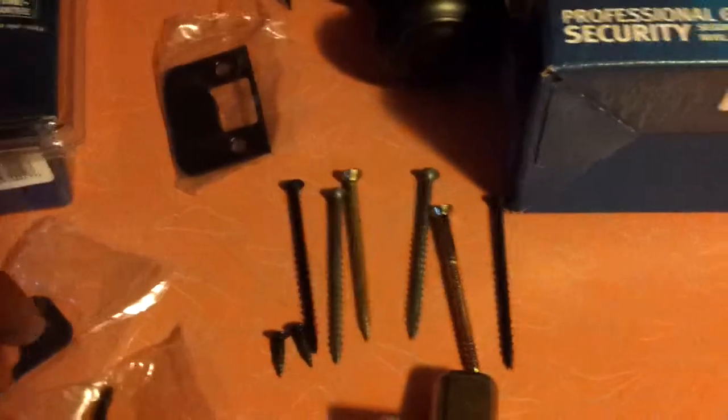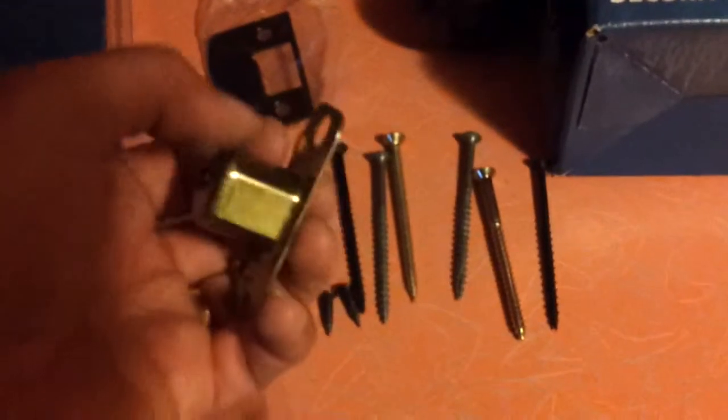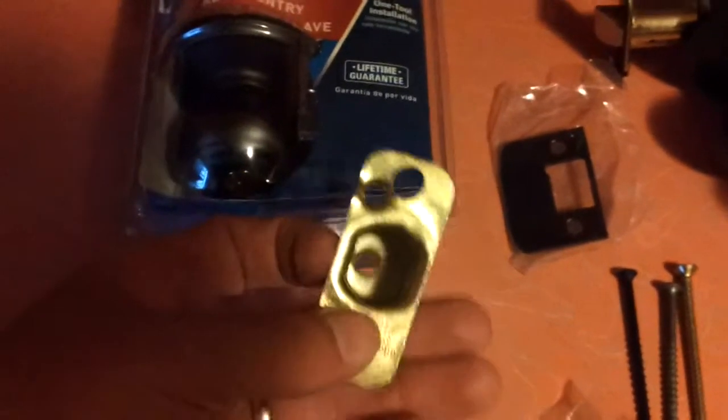You'll have a double stud right there in the door. This is also what the deadbolt goes into, and this does improve your lock a lot. If you have this reinforced strike plate, it's a pain to put in — you have to bore this entire thing out, chisel it out. But it slides in and it's made for a deadbolt. Well, if you have this behind it, you can drop in some massive screws — even one right in the back — and it will sink into the studs behind. Not relying on that tiny piece of wood that someone kicks and cracks. If you drop in some monster screws deep into two or three studs, it's going to take a lot more kicks to get in. They're better off trying to take it off the hinge side than coming in through the doorknob side.